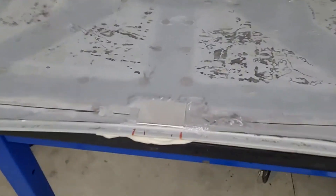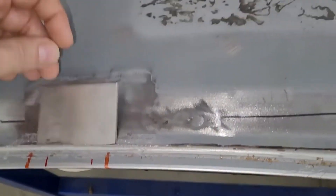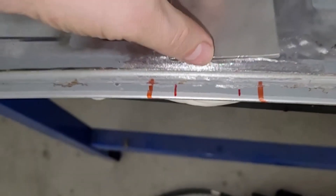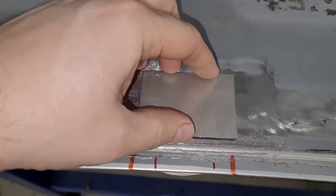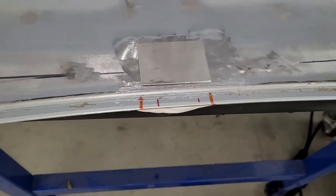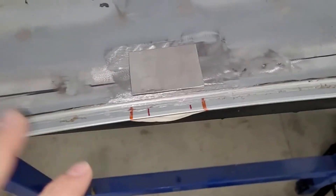Win or fail, this is what we're gonna do. I just happen to have these pieces - 304 stainless samples I bought for practice welding. I cut them to 2.67 inches and beveled the edges with a 60-degree edge to make it a little easier to weld. I cleaned the metal, and on the back side I've got a soaking wet rag laying up against the steel to try to keep it cool and hopefully not melt through the base metal as much. This piece is thicker than the skin of the trunk lid, but I beveled it to help, and we're only putting little tack welds.